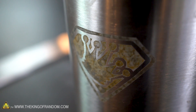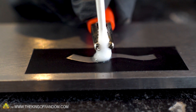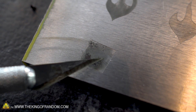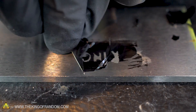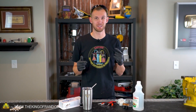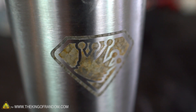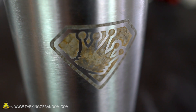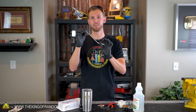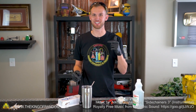This has been a really fun experiment learning how to use electricity to engrave into steel. It doesn't take a lot of work — you can easily use a 9-volt battery to make it work, or if you can find one of these AC to DC adapter cords, they work even better and give you a constant source of electricity that you know isn't going to drain and run out. We found that using the tape or the sticker works very well as a mask, and I couldn't get good results with nail polish. If you have anything metal that you want to permanently mark with a symbol, logo, or name — maybe a knife or a steel cup — you now know how to do that yourself. Special shout out to the channel Art of Weapons for giving us this idea. Thank you guys for joining us, and we'll see you in the next one.